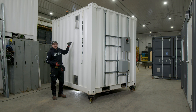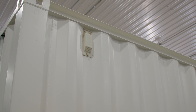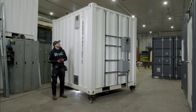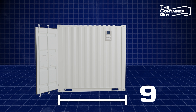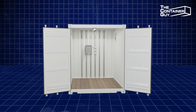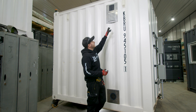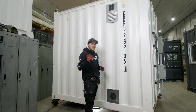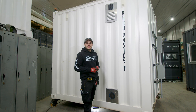I'm not certain fully if we're going to install an intake vent that matches that size yet. I really want to send this thing outside for a couple of days and see how much air I can feel through the stock container vents — there are a few in there, but they only ventilate the size of a nickel, so they don't do a lot. They're more meant for depressurization. This is a nine-foot container and it's got at least four of them, so they could act as the intake. What's strongly advised is potentially two Big Air 45s or two Big Air 30s for passive ventilation, and especially if your container is dark-colored or in desert areas, make sure you also get some active ventilation.